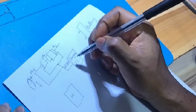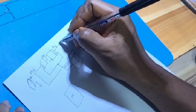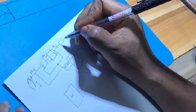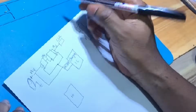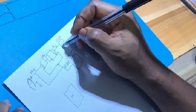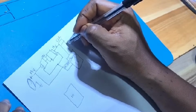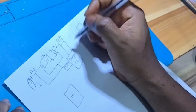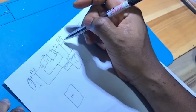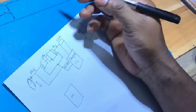So another thing, there is a resistor here, the CLR, current limit resistor. Let me call it CLR. This charging IC will have a connection with the input and the output of this resistor. Those two pins are very important, because the charging IC uses it as an ammeter. That is what this charging IC uses to measure the amps flowing into the laptop.